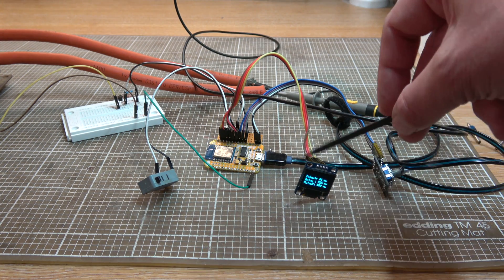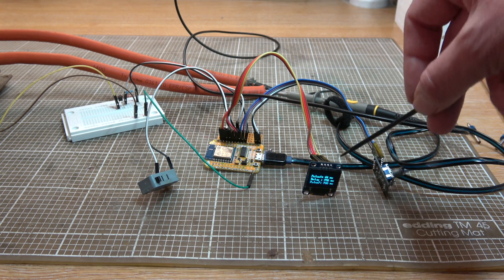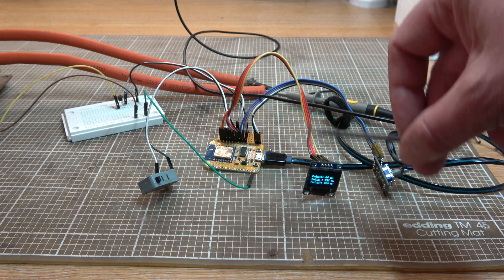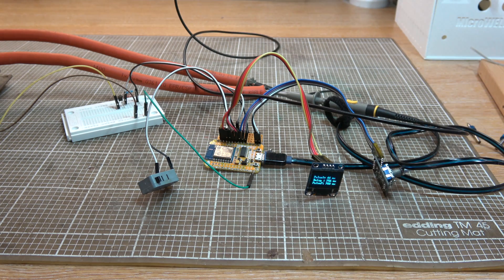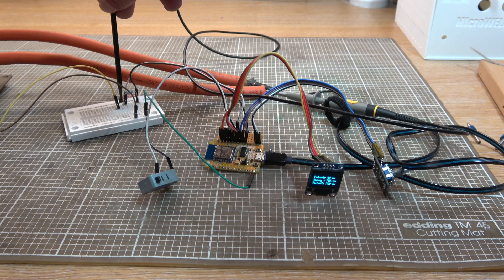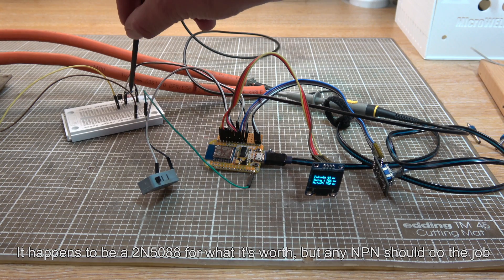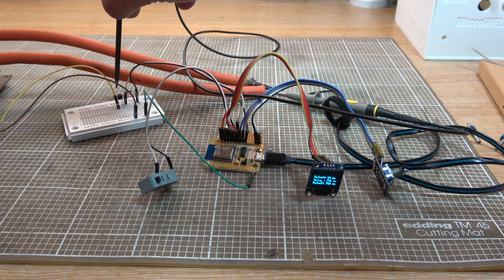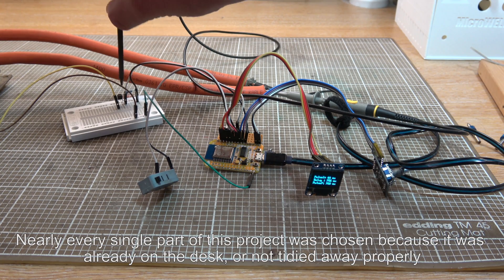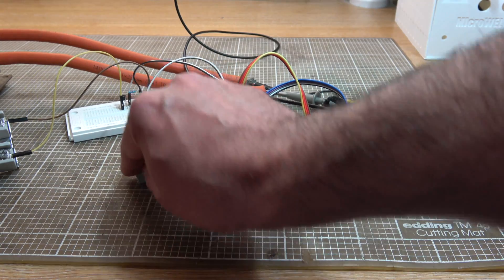Since the last video this is the first time I've powered this up, and the display seems to have lost half of its lines. But as I've got another nine of these spare I'm just going to swap that out. I've got this NPN transistor chosen on the basis that it was in my component tray, and a 2k resistor similarly chosen because it was loose on the desk. 10k is probably a better value but that was just out and about. However we are now working properly.